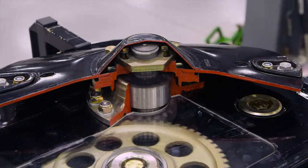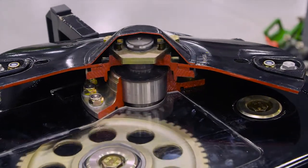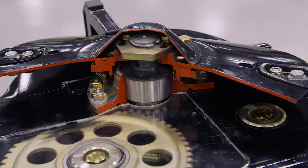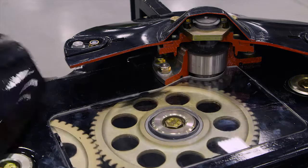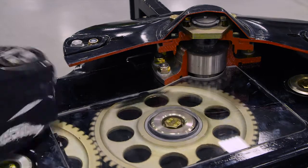This system incorporates a threaded spindle designed to thread the disc upwards and above the other discs in the event of shear pin breakage. This minimizes contact with other discs and prevents damage to the cutter bed gear drives.